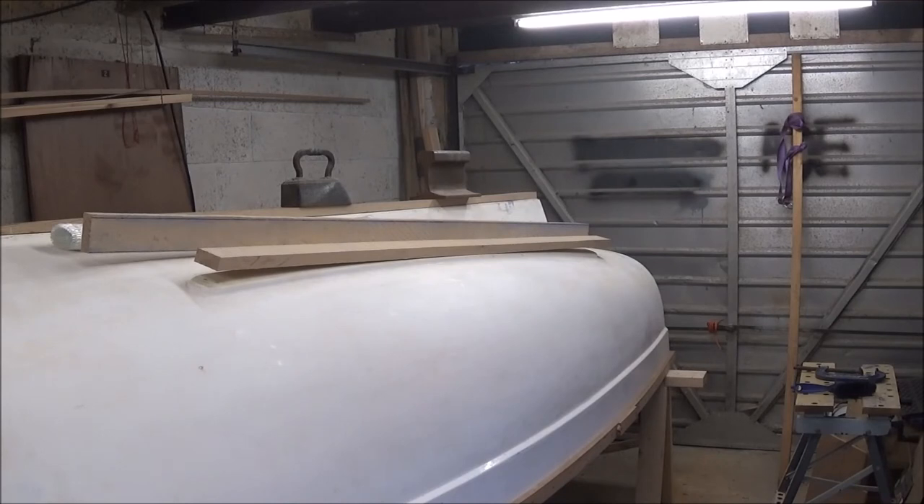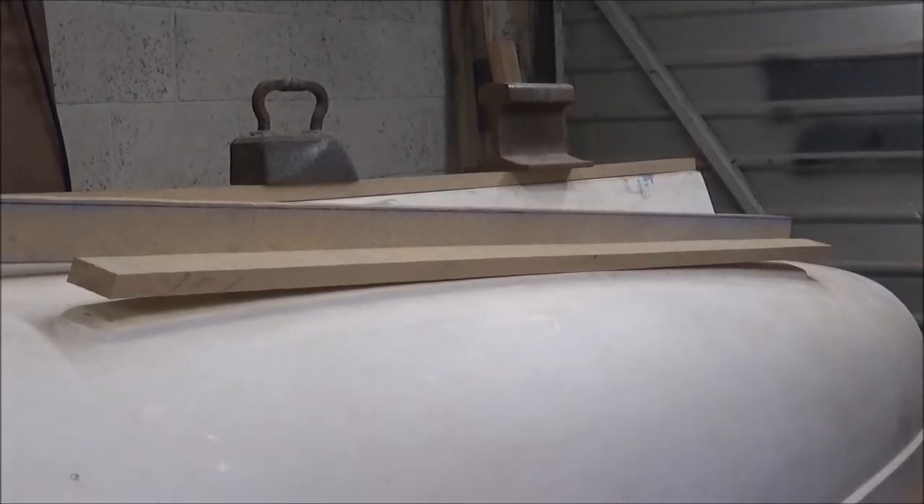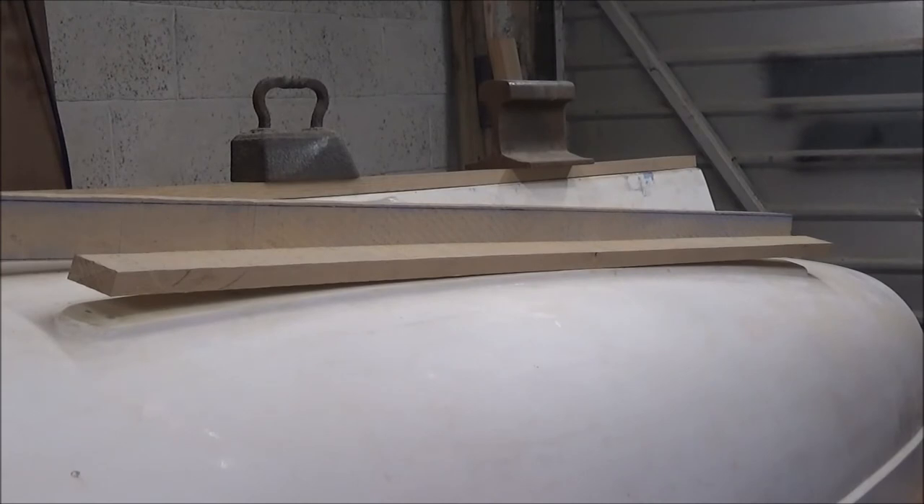There's the two rails cut out now for bilge runners. There's a lot of tidying up to do on them. They didn't move like the original piece did for the keel, but I think that's probably due to the fact that it tapered down quite a bit from one end to the other and it moved at the thinnest end — that was the weakest part. These look pretty straight once I've tidied them up with the plane down to the lines. I shall clean up the faces and then put them in the bag and bend them with the steam so they can form to the contour of the bilge runner base. And then I'll have to go to the old chandlers and see what they've got for fixings — either bronze or stainless bolts and penny washers.